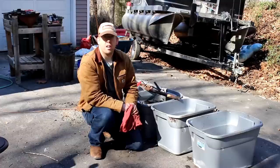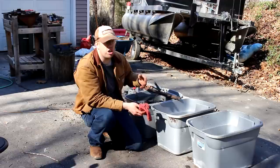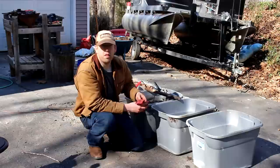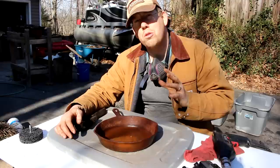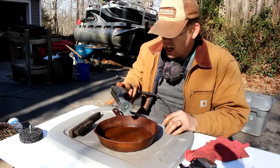Of these three methods, hands down my favorite is the vinegar bath. Electrolysis works but it's really fidgety — you have all this stuff to set up and you need to constantly move the anode around to get it evenly across all surfaces. With vinegar, you just dump the piece in a bucket and it seems to work fine. The Coca-Cola works but not as well as the vinegar and it's more expensive. There are stronger chemical products on the market, but I don't know if I want those soaking on my cookware for hours. All three methods just loosen the rust — you still have to use elbow grease to actually remove it. You can use a scouring pad, a chore boy, a wire brush, a drill, an angle grinder — whatever helps. I've got a wire adapter at the end of a drill and I'm going to try to get the remainder of this rust off, putting it back in vinegar to soak more if needed.